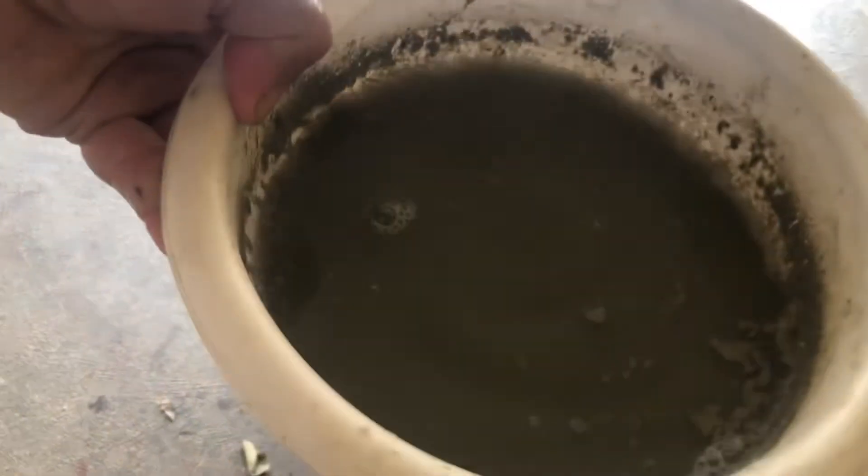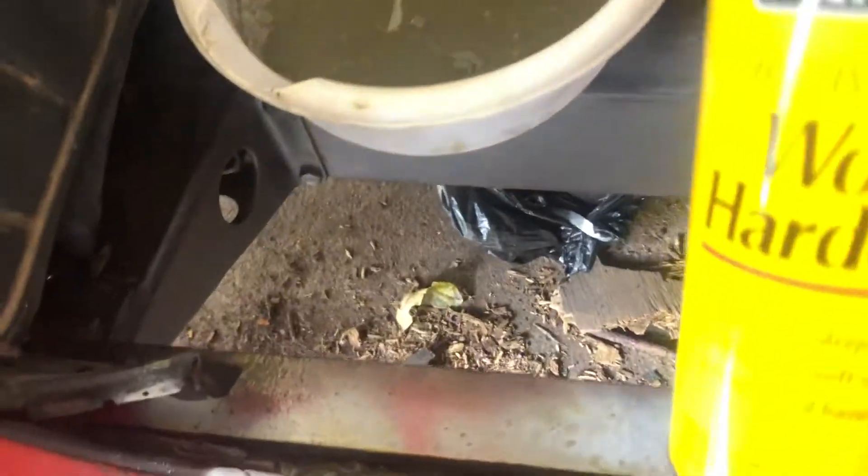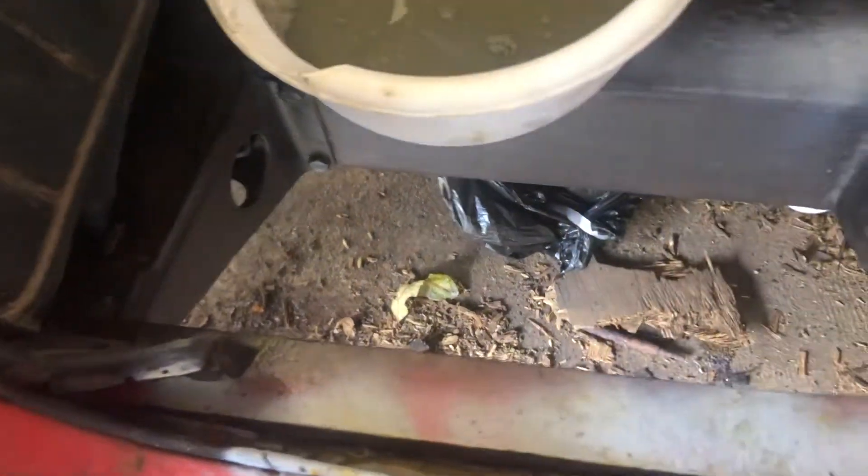So that's the horrible water it's in right now. That's the wood that I cut off — it's all rotten. You can see it all on the ground. I pulled all that rotten wood out and then I brushed wood hardener on it. It says you can let it sit for 12 hours or 3 hours before you can use it. I've waited 12 hours, so this is my final piece.